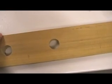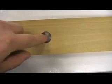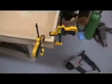Next I'm going to lay out the holes on the front part of the collar for the faucets. The trick to getting a smooth hole without any tearout through wood — whether using a hole saw, forstner bit, or spade bit — is to use a small pilot hole first. Go straight through the center all the way, then drill about three-quarters of the way through on one side, flip the piece over, and continue from the other side using the pilot hole as your reference. If you keep pushing from one side, by the time you get to the very end it'll tear out a paper-thin chunk of wood.